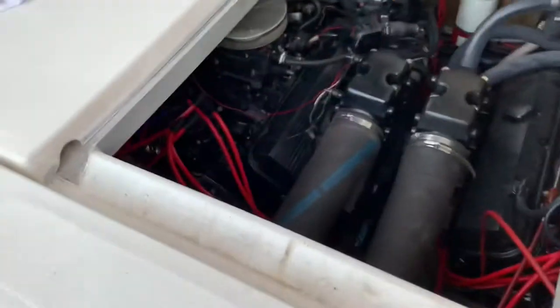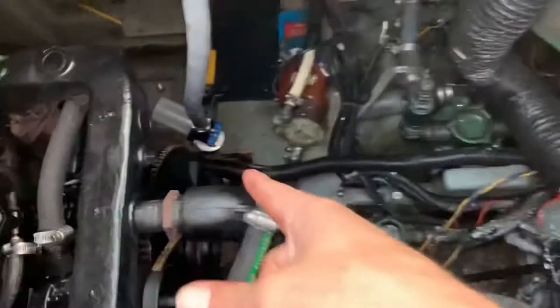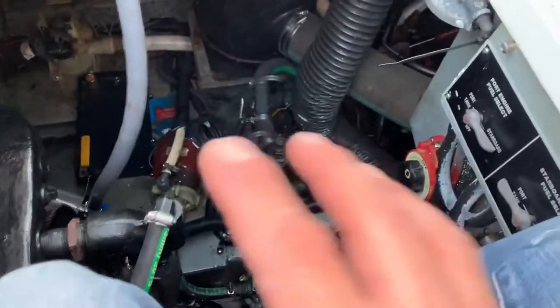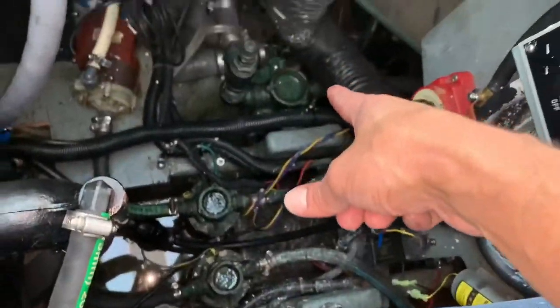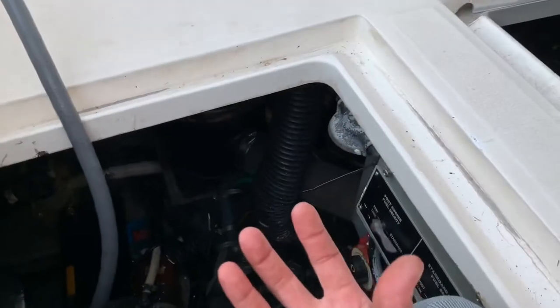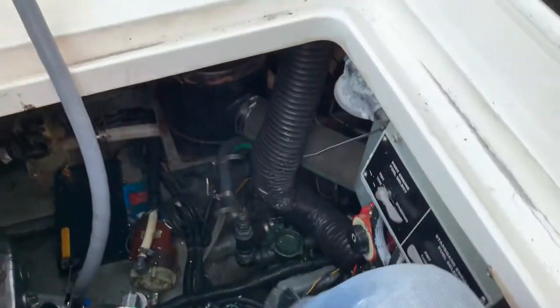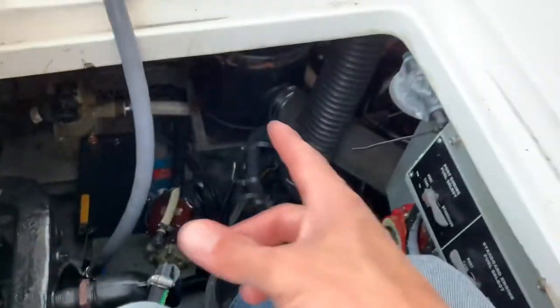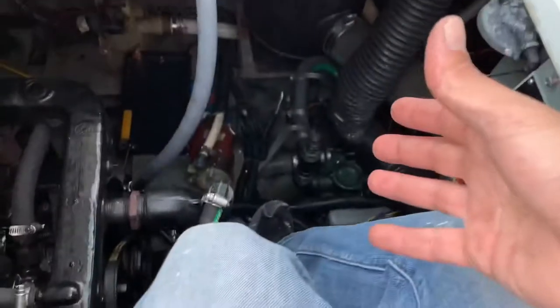Now when I go to turn the engine off, where I have messed up before is turning the engine off without disconnecting the hoses. What that did was pressurize my system so much that both of my filters broke — this one and that one. The bottom of the filter just popped out and they broke. I had to buy new filters, about $130, and it happened to me two separate times. If you turn the engine off without closing the seacocks or disconnecting the hose, you put the entire PSI of the building's water supply into your internal system, and it's not designed for that much PSI.